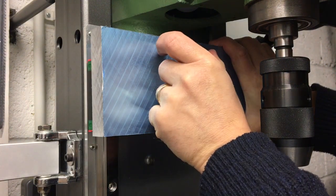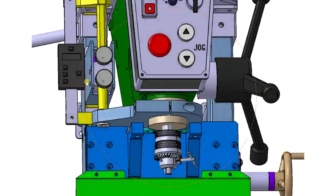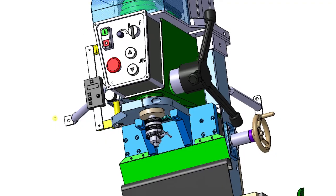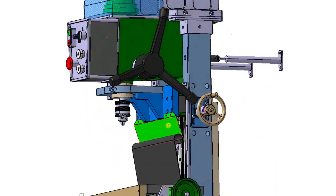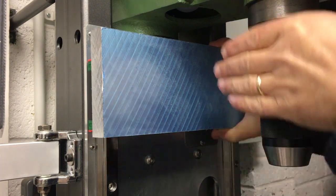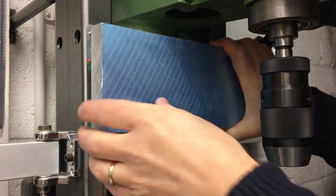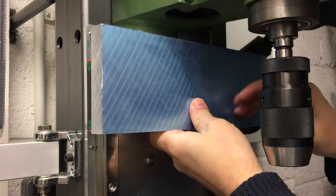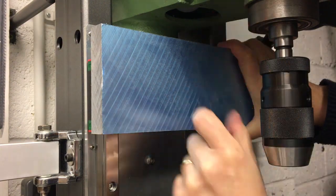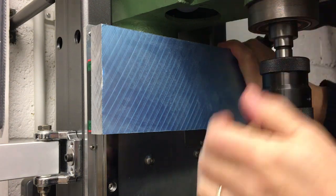And then there was another 20mm plate that would come out that was quite wide and would grab around the quill here. And the idea is, because these have a very small amount of movement in the ball there, there is a little set screw you can use to tighten it up, but it's not very satisfactory. So the idea was to keep the quill hopefully running in line with the rails, which were in line with the table, so try and keep some accuracy there. Now, this will also have some little triangular support brackets, again, 20mm plate. So it should be reasonably stiff and give a good secure connection to that.